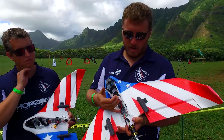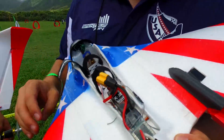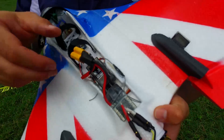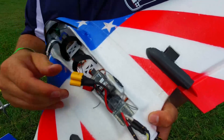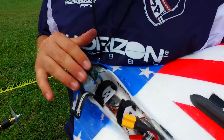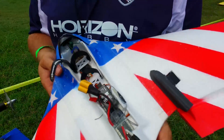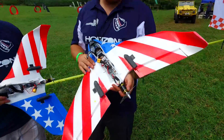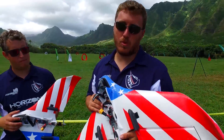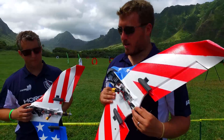The only thing then, if you do that, now you've got to go to a bigger ESC. We're running a nice 50 amp. It fits really well in there, pushing the ESC and receiver forward. We're running dual leads because we're running two 4S 1000s in parallel, so they're taped together and sitting right down in there. Running those in parallel gives us about two and a half minutes of wide open. With the loiter system we have about 30 seconds of loitering and then wide open, and the packs are coming down at about 20 to 25% left in them — not overly warm, a good setup.